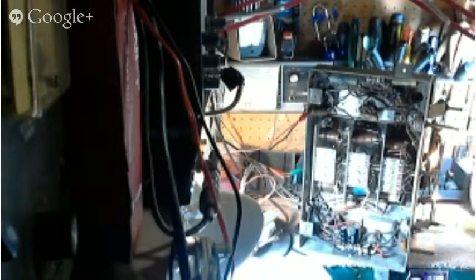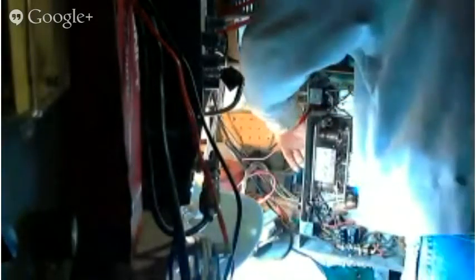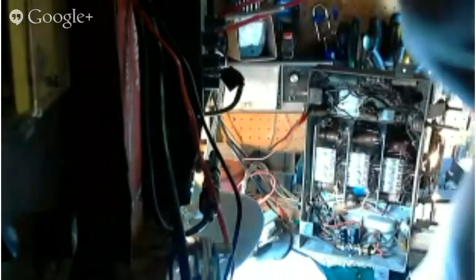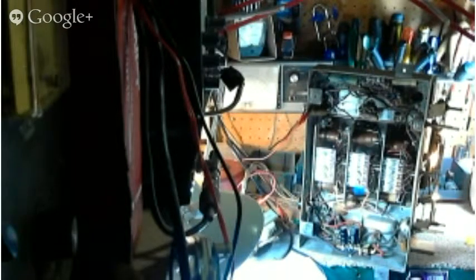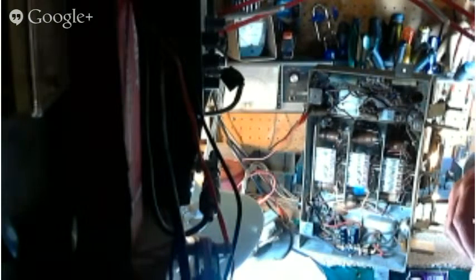So let's set up for that. We can remove the lead from the grid. Put our signal generator onto the antenna input. And a little bit of the IF leaking through. I think there's an IF trap in here too. Maybe we can adjust that somewhere down the road. Okay, so we'll go up to 1500 on our signal generator.